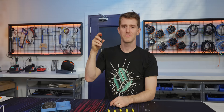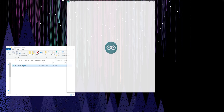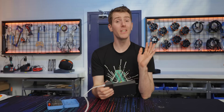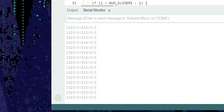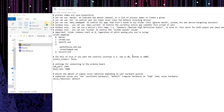So far that's all this does — we need to program the controller in order for it to do something useful. Thankfully, the Deej project has done almost all of the work for us, including providing a pre-written Arduino sketch file. It's not quite plug-and-play; we need to tweak it depending on how many pots we're using and which pins those pots are connected to. In this case, we've got five pots using pins A0 through A3 and pin A7. Compile that, upload it to the controller, taking note of which COM port the controller is using.